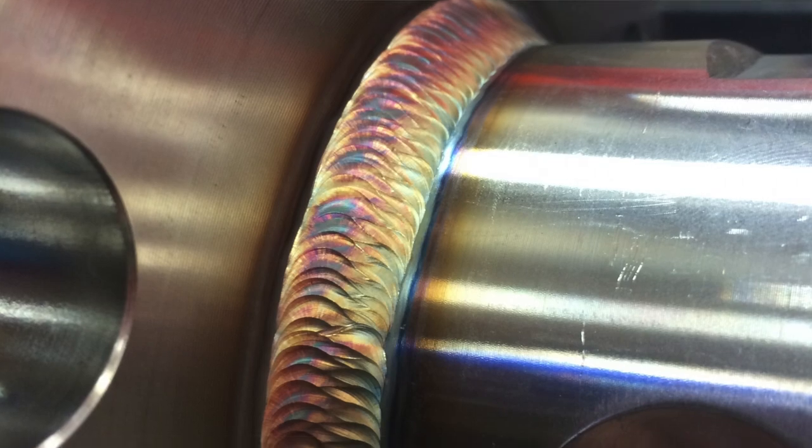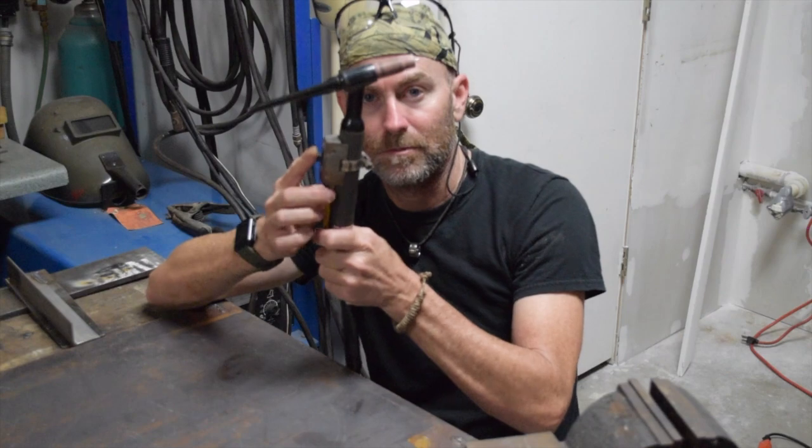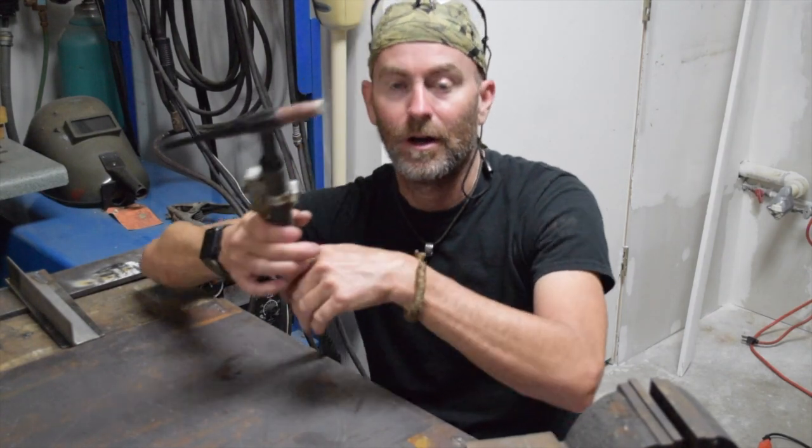The method I'm going to use today is called TIG welding, which stands for tungsten inert gas welding, also known as GTAW or gas tungsten arc welding. It's probably not the best place to start if you're a beginner. The vast majority of my experience with TIG welding used a foot pedal to control the amount of heat put into the work. This torch only has an on/off switch on the handle operated with your thumb, so you're probably going to see some awkward and not particularly beautiful welding from me today.